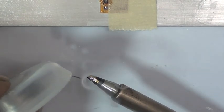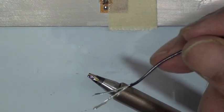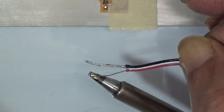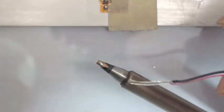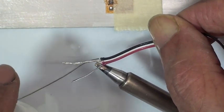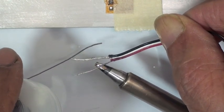And the way that you accomplish the soldering with low temperature is you have to use a flat type tip, a chisel tip, or screwdriver type tip. The idea is you want to hold the iron level and get the entire flat surface of the tip in contact with the entire flat surface of the area of the solder tab. This transfers heat simultaneously to the foil at all points and allows you to make a very quick solder connection.